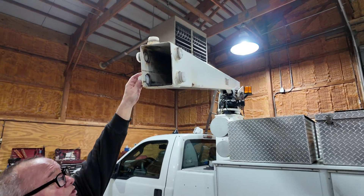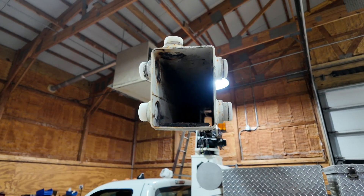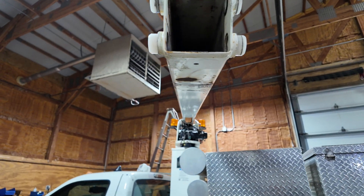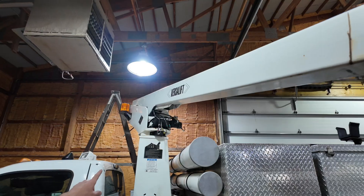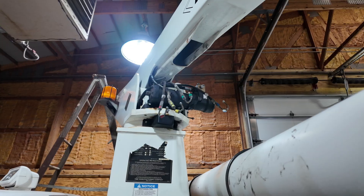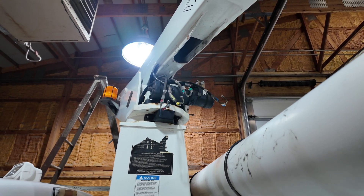These are our adjustments for our side and up-and-down play. We just want to back all of them out. There's a pad on this one that sits right here — it just sits right in a groove there. At the other end, we have some hydraulic lines. You can see right here, there are four of them disconnected. And at the very end, we have a couple more hydraulic lines there, and that's where we'll unbolt the cylinder to remove it.